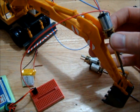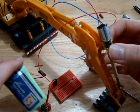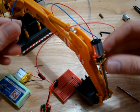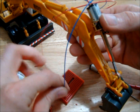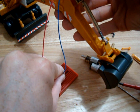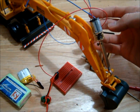This motor is good to 6 volts but I've been using 3.7 volts here. I've got a UBEC that should let us regulate our 7.4 volt battery down to 6 volts, so let's try that and see how fast that is. That's a little bit faster but still maybe not fast enough.